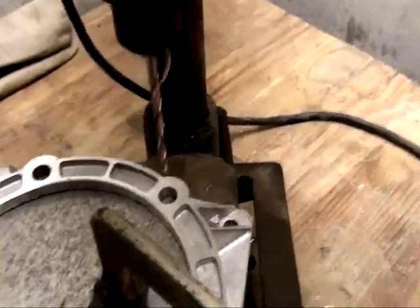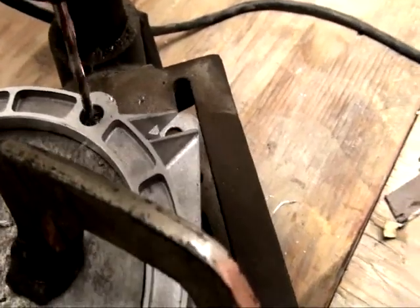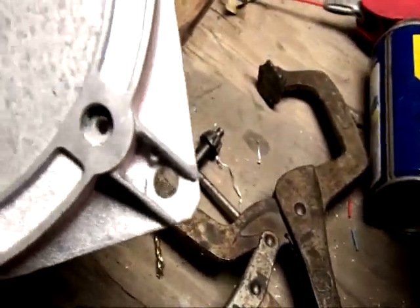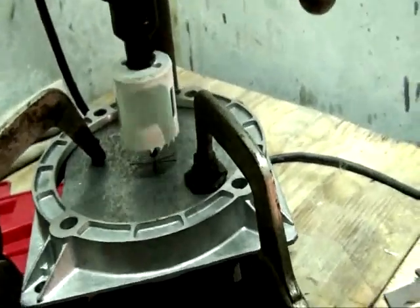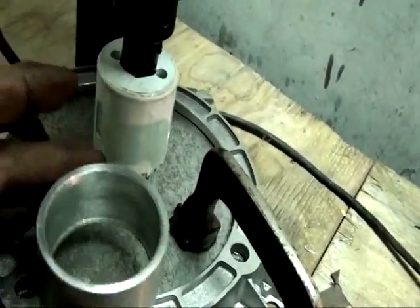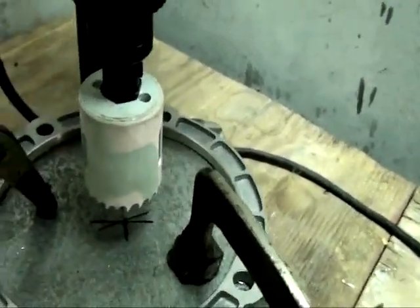So with the 2x4 it's easier — once you got it all pressed in here — to go right in the center of it, and there's not gonna be any vibration, you got it all secure. It's all there. So here we're ready to drill right off the center. The hole is gonna be a little bit smaller than this of course, so we can have a gap to play and set it up, and still be able to take the plate off and push the bearing whenever we need to replace it.